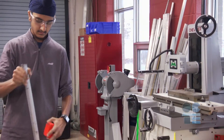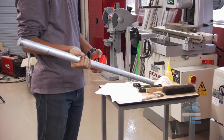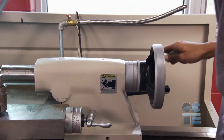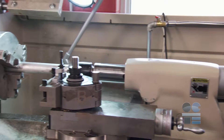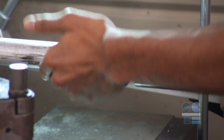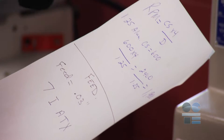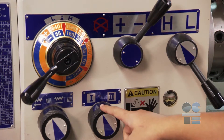In the event that you are machining a longer work piece, the work piece needs to be supported using a revolving center in the tailstock. You should always support a work piece that is longer than three times its diameter by holding it at both ends, as the knurling tool puts enormous pressure onto the work piece. Knurling tools work best at slow speeds, so set the lathe to a quarter of the recommended speed for turning.